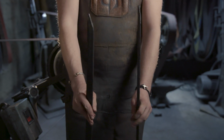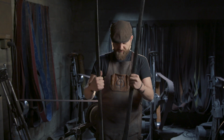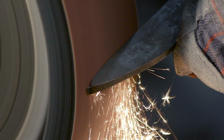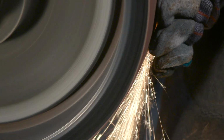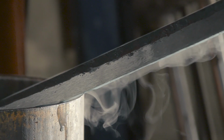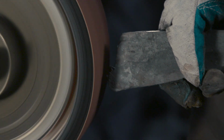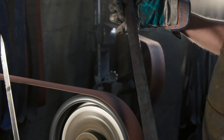All right, both our Soul Calibur blades are now forged. It's pretty awesome. Two very organic pieces turned out perfectly. I just have to start by truing up the perimeter. Each hammer blow adds a little bit of regularity. Then I can move on to grinding the edges. The bevels are already established during the forging process, so I already have guidelines in these blades to go. I just have to start grinding on them, get them down to the proper thickness, and then we can heat treat.